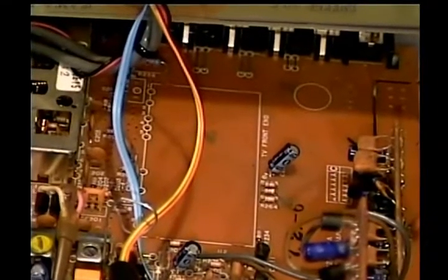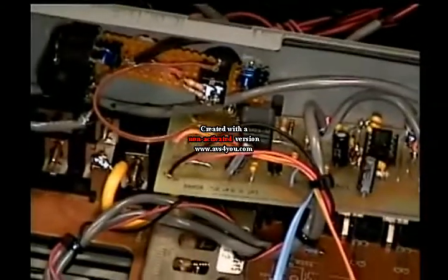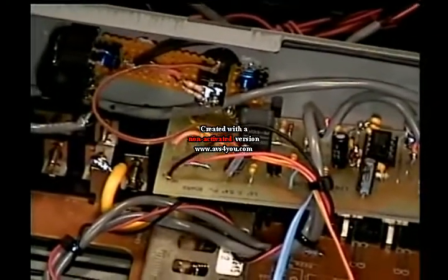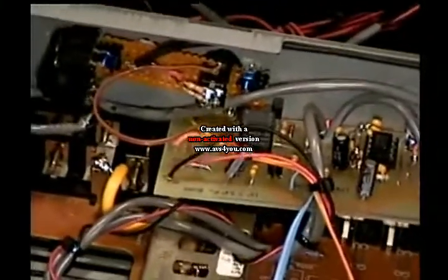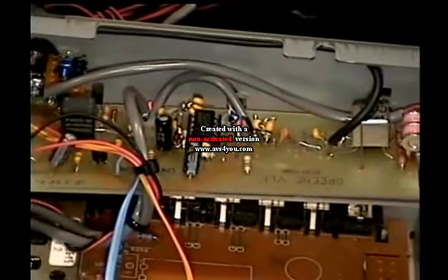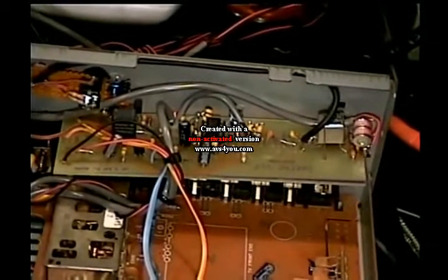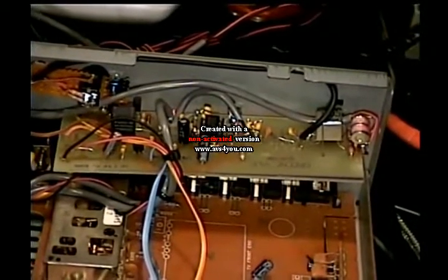Here we have a location on the main circuit board — let's pan around a little bit. We're in the AM/FM/IF system right here. We've got the FM tuner pack and you can see a little corner of the VLF board, with wiring going underneath to the appropriate points on the circuit board. There's a little bit of yellow mini coax — that's where the F connector is. While I was in here I put an F connector on it for an external FM antenna, which I like to incorporate so I don't have a pigtail with an adapter hanging off the back. Here's the custom-made VLF board that I made especially for this modified stereo receiver.